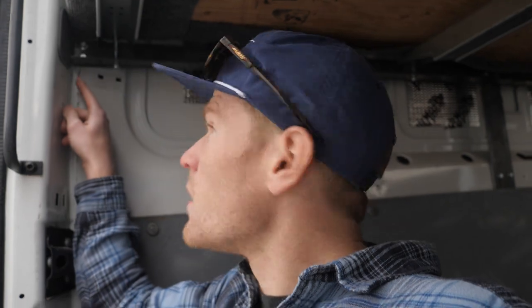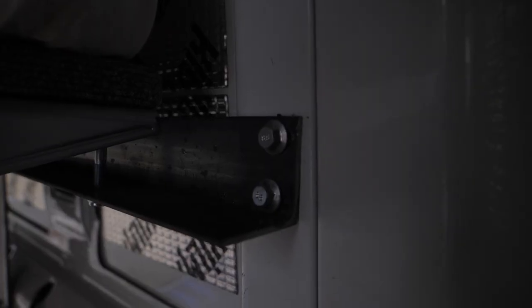Biggest thing that I think most people have been interested in, that I got the most questions about, is the bed here. So the way I hooked the bed onto the wall, I put rivnuts into the wall. You basically get some threads that hook into the wall that you can then thread a screw into. I got these big chunks of angle iron at Home Depot. These bars here are just the center pieces from IKEA beds. And I just have 2 pieces of plywood sitting on top of that.